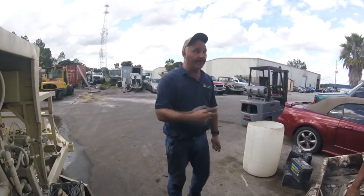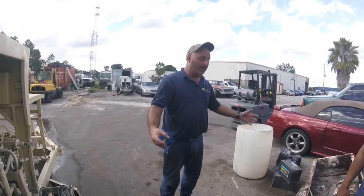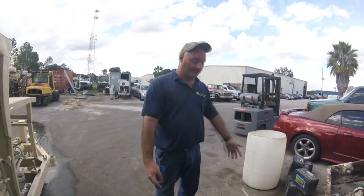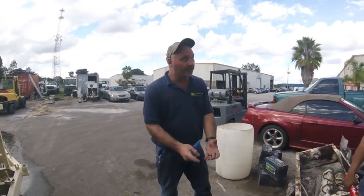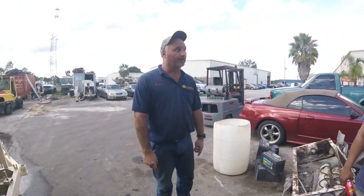Okay. Now I remember when I was in Houston, they were pretty critical about you dumping just concrete on the ground. So I don't know if you need plastic or a concrete box or what, but I remember they were pretty rough over there. They didn't want you just dumping anywhere. You had to put a bag or a sock. A trash bag works good. One of them construction 55-gallon trash bags, put it over the hose, twist it around, and all the sand and rock will stay in the bag. The water will come out on the ground.